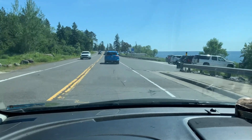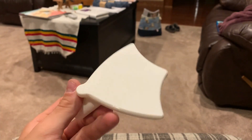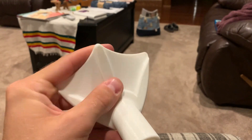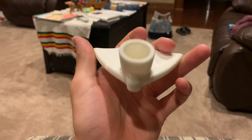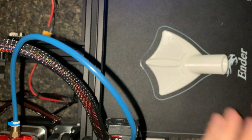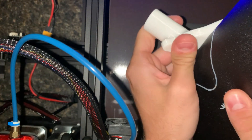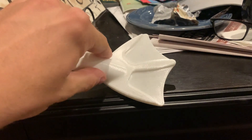The next weekend I traveled back to my hometown to see if either the hinge version 2 or the flexible options would work. I ended up printing three flexible feet. The first appeared to be very high quality but had two problems: large folding points that concerned me about longevity under consistent use, and an oval-shaped leg shaft caused by accidentally extruding two concentric circles at an angle. The second corrected this issue but wasn't the most successful print. The third flexible foot rounded the corners of the pinch points and contained a slightly larger cylindrical shaft, which increased the strength of the plastic and caused less toe flexibility compared to the first print.